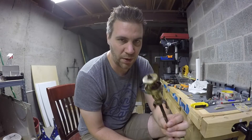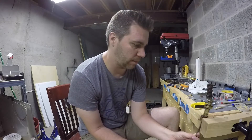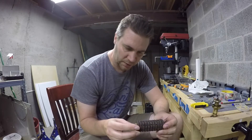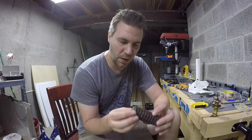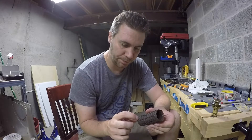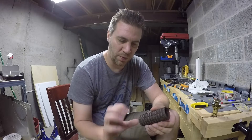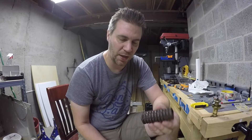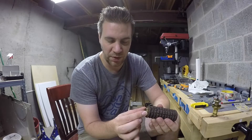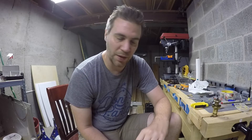I've barely started on it, but it's still pretty unresponsive to everything I've done. The frag body is in similar condition to my earlier one. It's not as gunked up though, so I'm gonna do an electrolysis on the frag body to remove as much rust and gunk as I can, because that was very effective and pretty gentle. But first I have to remove this piece, and it's not moving, so I'll probably do my acid bath like I did last time, because that worked extremely well.